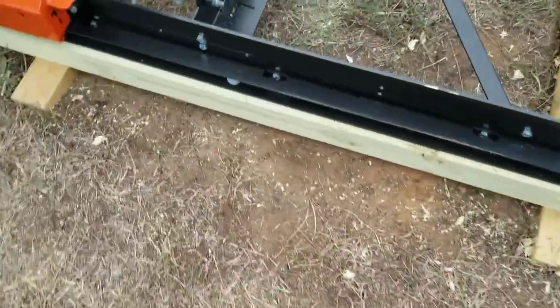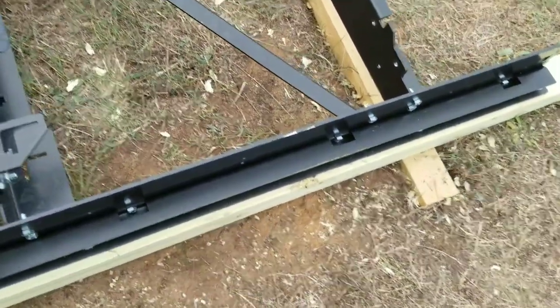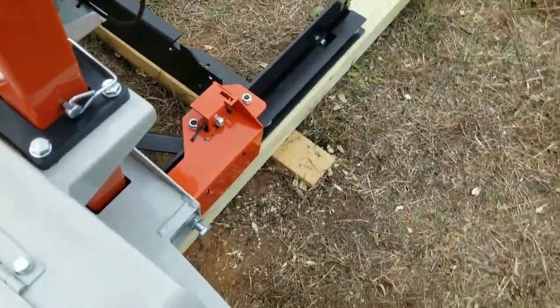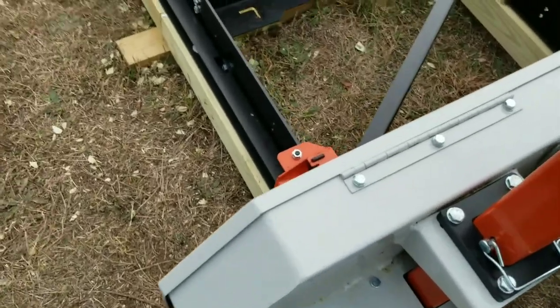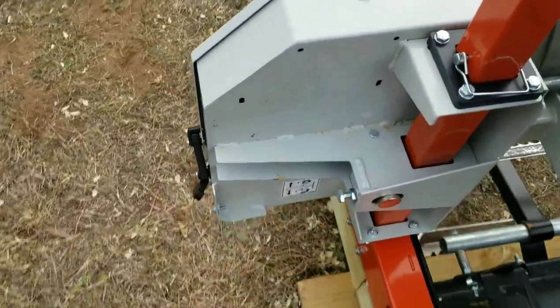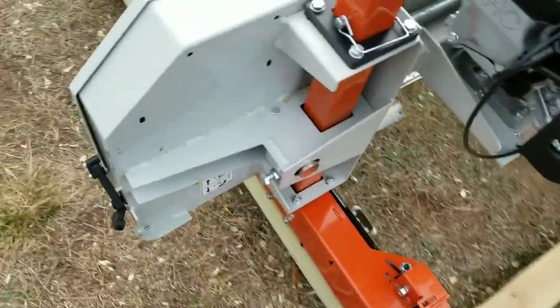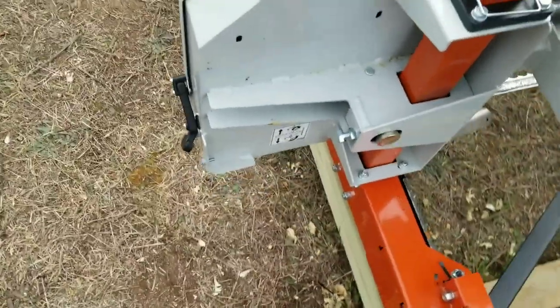One little minor hiccup. These catch rails are bowed up just a little bit. You see it catches right there. And every one of these in the middle has a high spot. It pushes along smooth and easy, and then it catches. Nice and smooth. For some reason, that one's the unusual one. That one's fine. And then this one, it catches again. You need to push a little more.